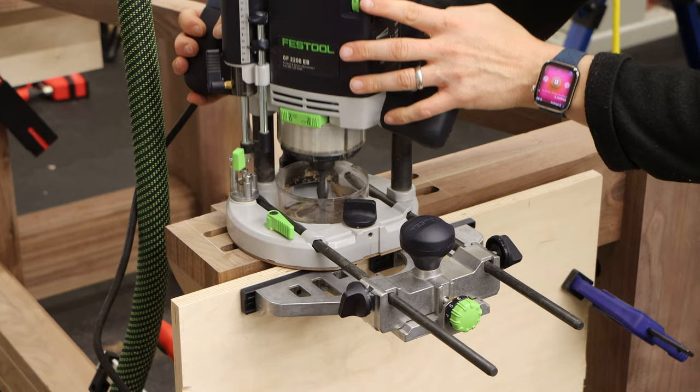The rest of the build is pretty straightforward. I level the top a bit more with the jointing plane, then go over it with the smoothing plane. After, it gets a light sanding and then finish. I decided to buy self-adhesive cork, and that was a great decision — it's easy to cut, easy to install, and so far it hasn't fallen off. And just like that, the sliding split top part is done. I went with an interlocking shelf design with a keystone shelf in the middle. I wasn't sure I liked the look of the walnut base until the shelving got installed, but afterwards I think it looks great.